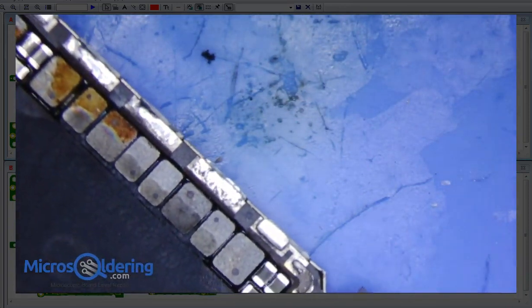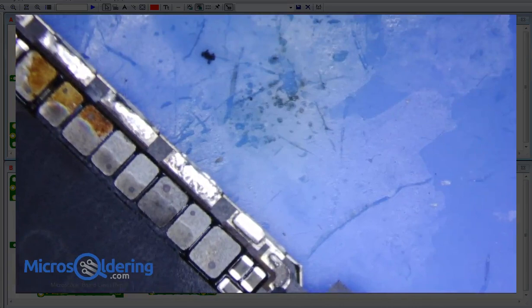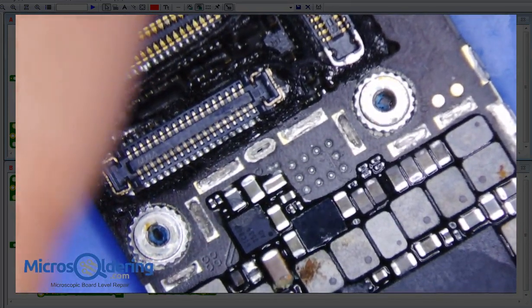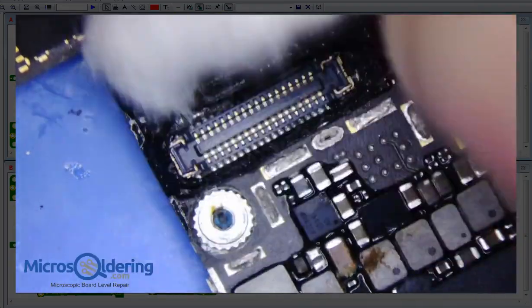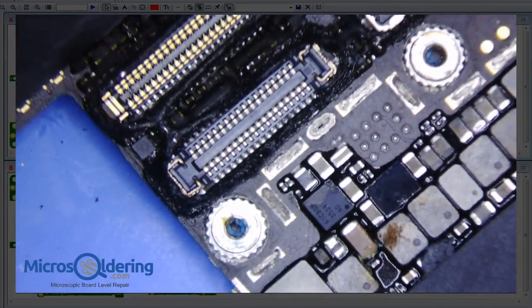Data recovery is a pretty time consuming thing, and I would say the success rate is not great on these things. I don't know about other people, but I would probably say less than 50%. If it is recoverable, it's usually something like a backlight issue or maybe a known shorted cap. And phones that have been fully submerged in water, those are even harder to recover the data on.